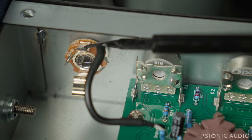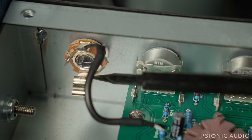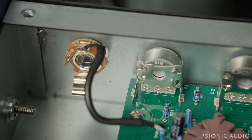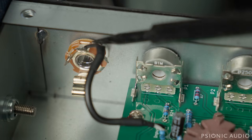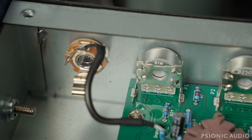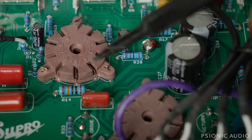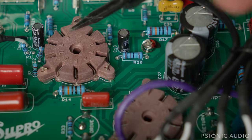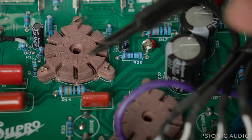You can see a lack of a toothed washer on this input jack, and it is not a Switchcraft — it's a generic jack. All the speaker jacks are the same way; these like to go loose in the current Supros. And while these sockets very closely resemble Belton Micalex, they have this weird plasticky grainy texture. These are not Belton Micalex — these are some kind of copycat.